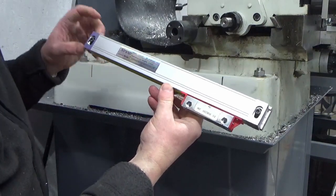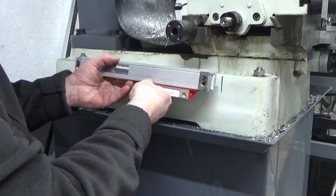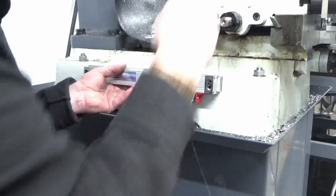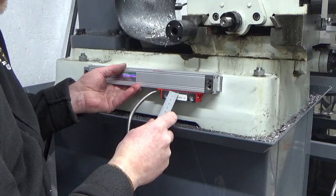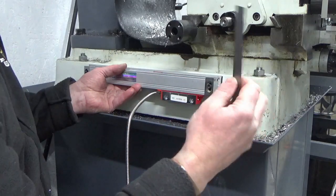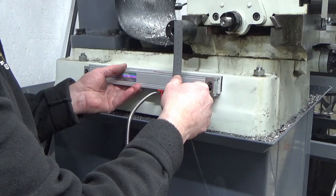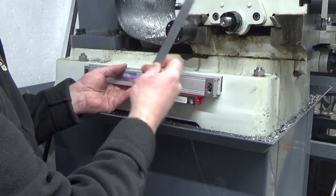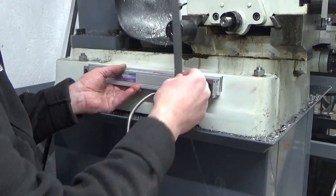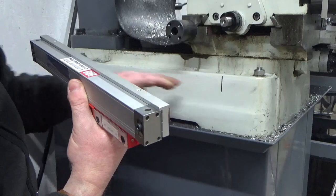I've just temporarily mounted the scale to the backing plate, just because I don't have enough hands to hold everything. We've sat that up against the casting. With the other two scales, fortunately these scales are marked, so I've got a centre dot on the reader and a centre dot on the scale, so I know I've got that 8-9mm of spare travel at this end. I've set this rule up with a square and had it roughly clamped to the boss, so that I knew my rule was square this way, and I've eyesighted down to the centre dot on the reader off the centre of that boss, and used a sharpie marker to put a mark at each end of the backing plate.